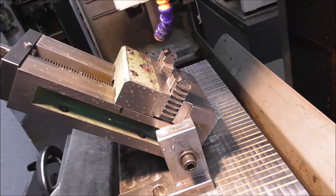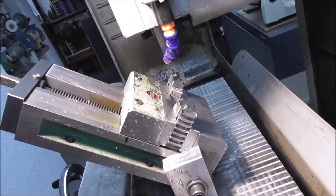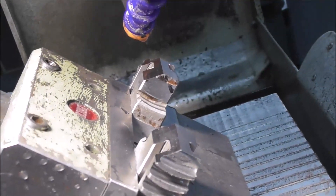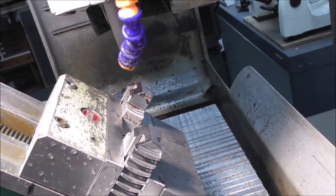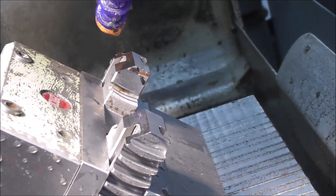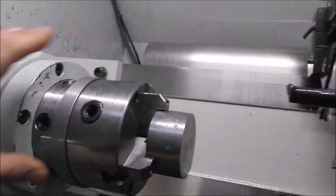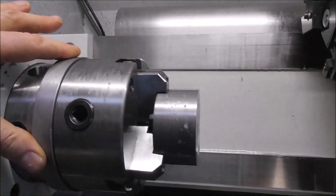Now I've set the jaws up — two up. You can hold two parts in a vise like this; the jaw floats and clamps both of them. I'm grinding the 45-degree angle by the same plunge grinding method. I'll flip it round now, go to the same number on the dial, grind the other side to the same depth. Then do a traverse cut, because the plunge grinding very slightly wears the middle of the wheel. The traverse cuts with the sharp edge on either side give you exactly the same dimension — not that it's critical, it's only clearance. There are the modified reverse jaws. That'll be quite a versatile, useful five-inch chuck with reverse jaws.